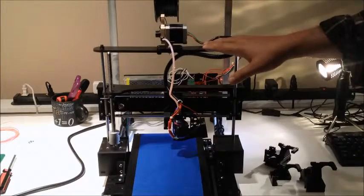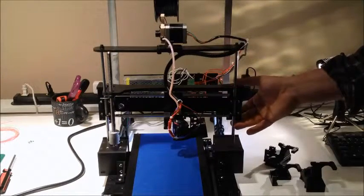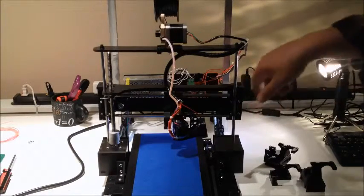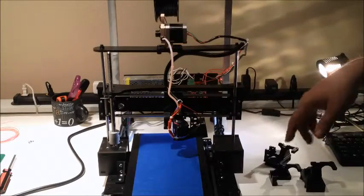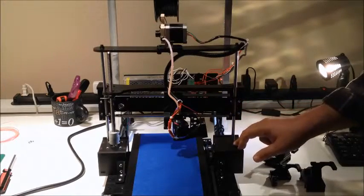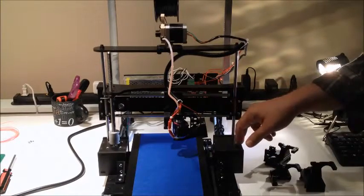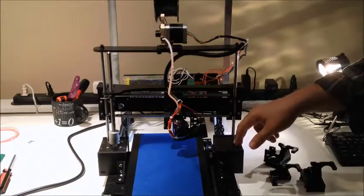This is where buying the kit was a bit of value. But if you're really looking for quality prints, the single Z-axis is just a big problem. You can jury-rig it as I will do with springs or pulleys, but nothing is going to beat having that second Z-axis. So if you're really going in this direction, pay the extra $80 right up front, get the additional Z-axis - I think you'd be a whole lot happier.